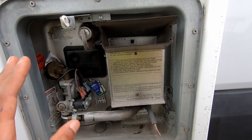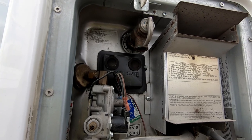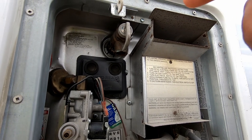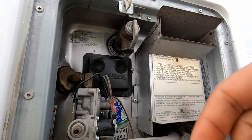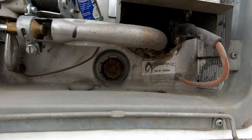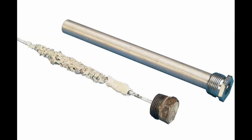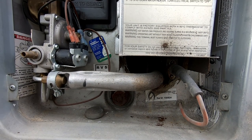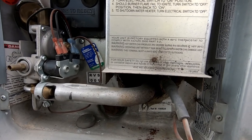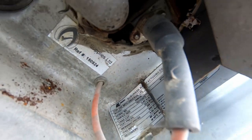Use a soft brush and make sure it's cold when you do this. If you're parking up during winter in a cold country where it snows, you want to drain the hot water heater — especially if it goes to minus five or ten degrees, you don't want it cracking. To drain, just use this quick release valve. Also on this particular model there is an anode down here — it's a sacrificial rod to protect your water heater from corrosion. Here is the model number of the Suburban water heater.